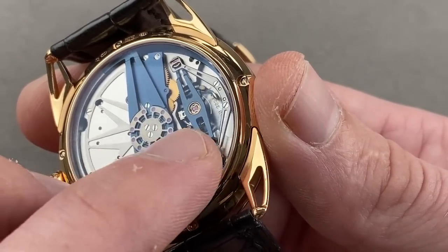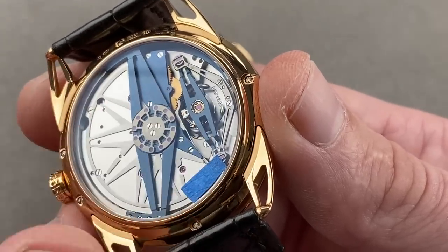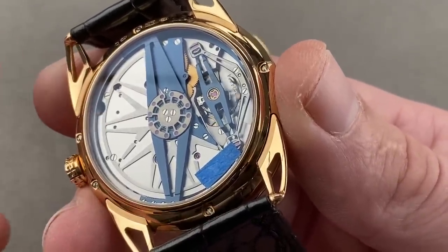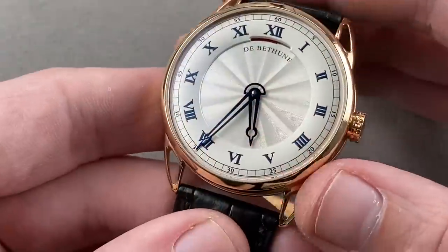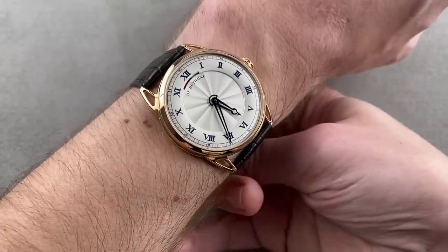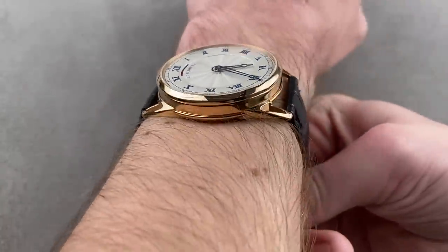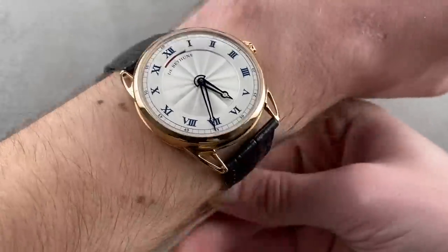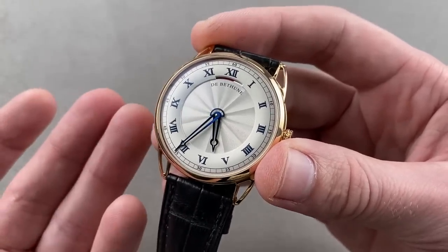The balance is a yoke — not a wheel, a yoke, cruciform — with a titanium center, and the masses at the edge in bulb form are made of platinum. So it has very little reaction to hot or cold; expansion or contraction will not change the timing of the watch, and the platinum puts all the mass to the degree possible out at the edge of the balance wheel. The hairspring is two pieces shaped by hand and clamped together, giving you the concentric breathing of an overcoil in any position with respect to gravity, but without the thickness or shock susceptibility of an overcoil. On the wrist, this is a beautifully sized watch. These are extremely rare — only a few dozen per year. De Bethune never made more than about 425–430 watches in a year at its peak from about 2011 to 2014; today the company makes about 150 watches a year and has made fewer than 3,000 since its inception in 2002. You get real rarity as well as engineering and craft value.